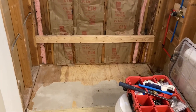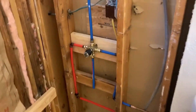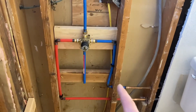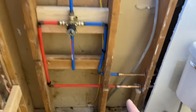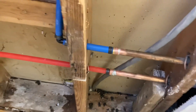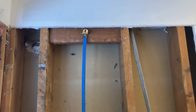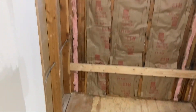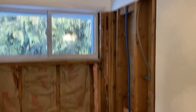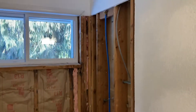I've installed a cleat on the backside so the backside of the tub can rest on it. We'll see if we need to install one on the other side. Then we move on to the next step: installing the water valve. I used PEX, which some people dislike, but that's up to them. We've got fittings soldered here, and blue for cold, red for hot into the shower valve. It's all pressurized now and I'm checking for leaks before installing the concrete board.